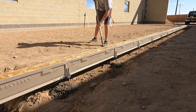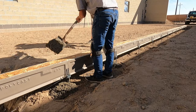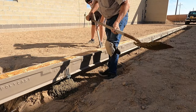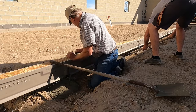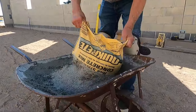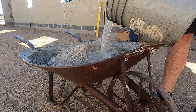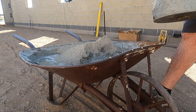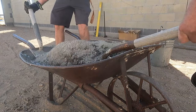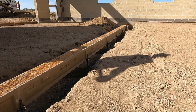The next day we opted to mix up some more ready-mix concrete and throw a couple of shovels full around each chair with the hope that this will really help solidify the mounting chairs and prevent any movement when the floor is poured. If they aren't rigid enough, the drain could tend to move depending on how aggressive the concrete guys are, and in addition the drain can actually begin to float if not anchored well. Each section of the rebar is a couple feet in the ground so it probably wouldn't happen, but we'd rather be safe than sorry.